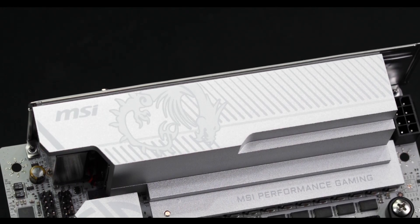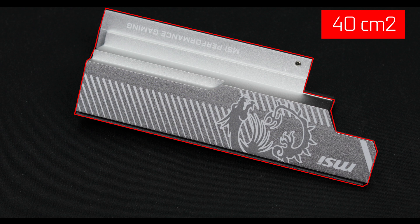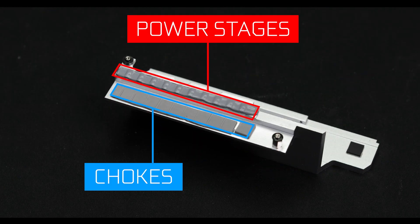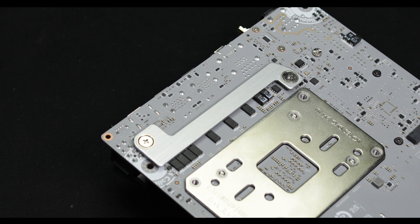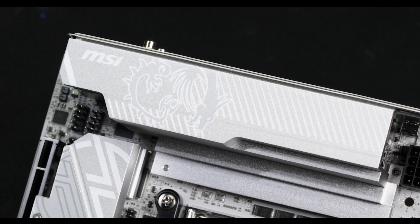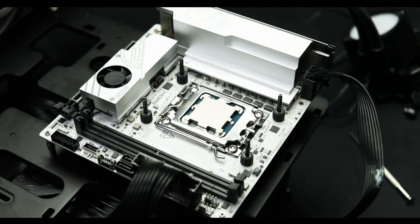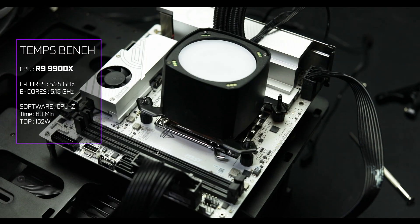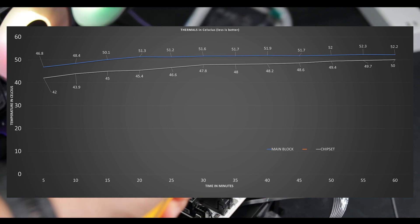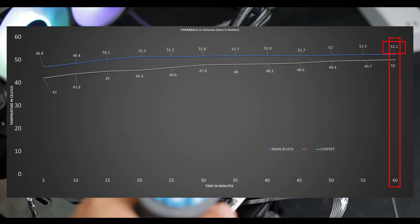Let's take a look at the single massive cooling block, which shows a compact yet efficient 40 square centimeter radiating surface, fed by 34 dense cubic centimeters of aluminum, all fed by a double contact design plate — actually a triple contact design, because the soldered points on the other side of the PCB also benefit from a dedicated thermopadded aluminum heat shield. With 3 watts worth of heat dissipation, it is more than appropriate. After running an R9 9900X for an hour-long synthetic stress test, temperatures were not only surprisingly low but stable, peaking under 55 degrees Celsius.